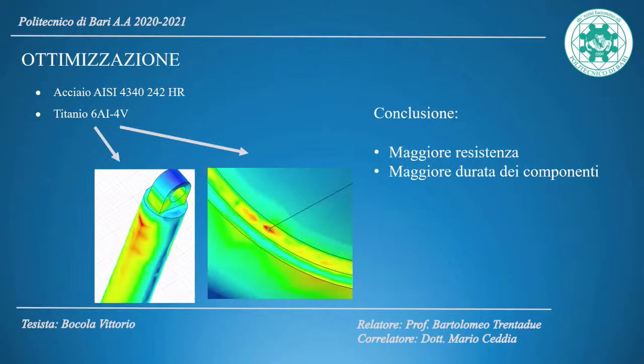Optimization was carried out for different materials — steel and titanium — and it was found that increasing the wall thickness of the hollow section and the fillet radius at the pin notch led to a significant reduction in Von Mises stress. In conclusion, the application of simple and intuitive design concepts brought notable benefits to the landing gear components. Stress reduction translates to greater durability and improved resistance. Static analysis via Fusion 360 enhanced the performance of individual components, making the overall landing gear more reliable — a highly sought characteristic in the aeronautical sector.